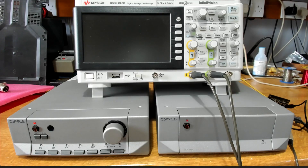Here's another Cyrus project where we look at the MC bus — this is where we connect different units together so one unit can control the others, and your remote control operates several units at the same time. I've got a single Mono X here connected to a Cyrus 7, and if we power on the amplifier, the Mono X comes on also, working in sympathy. That's our MC bus operation — it works as a master-slave configuration.